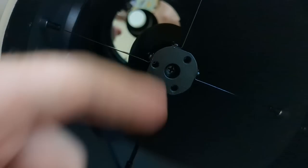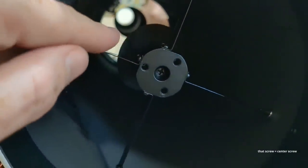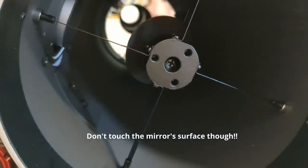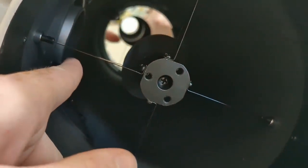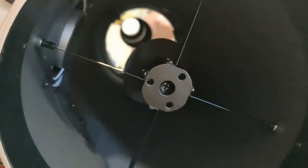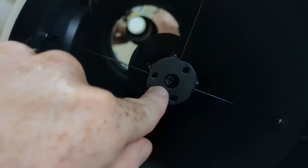When you're pushing the secondary towards the inside by loosening the center screw, it reaches a point where the secondary mirror might fall off, so you need to hold it with one hand while loosening with the other. You can use a sight tube from the focuser assembly to really center the mirror, but for very fast Newtonians there's a bit of an offset, so even when you've centered it perfectly it might not be quite perfect.